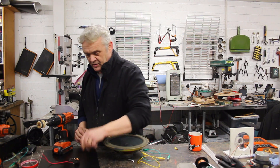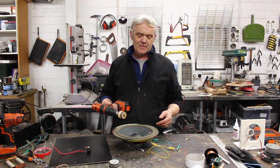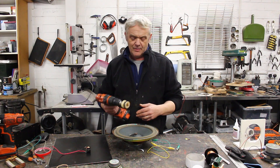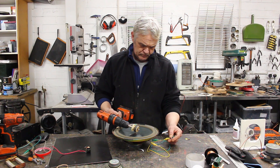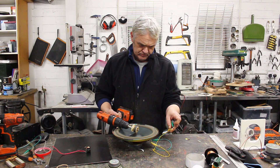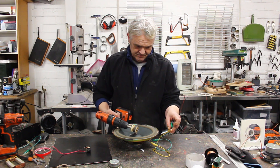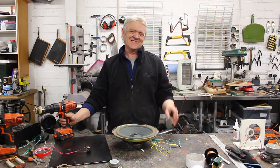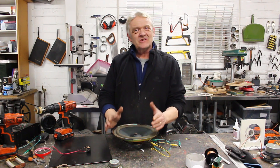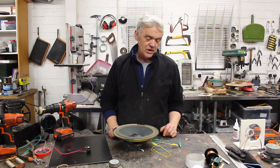Let's put a magnet on there. As I spin this magnet above the magnet on the speaker, the magnetic field is going to push and pull on the magnet beneath it, and the timing will be the rotation of the drill — and that should light this. Okay, that's kind of cool, it really is. So a speaker, remember, is just a linear motor. All motors can be made into generators, so we can make the speaker into a generator just by doing those things.